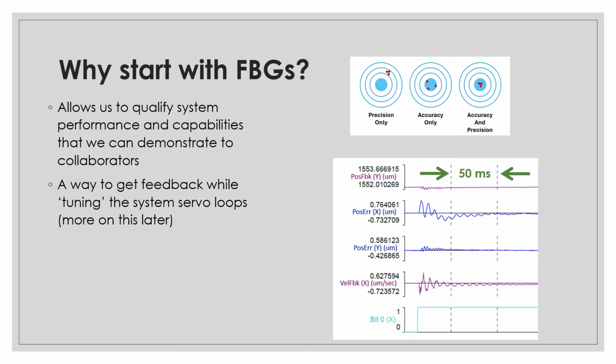If we can get better, I would love to get better, and sometimes we can. It depends, honestly, on the time of day. Buildings and vehicle motion on campus during the day can introduce a little more noise than in the evening. So it's actually beneficial to be running tests in the evening if you need very high performance. But we did manage to get our position errors quite small, even on the order of 10 nanometers.